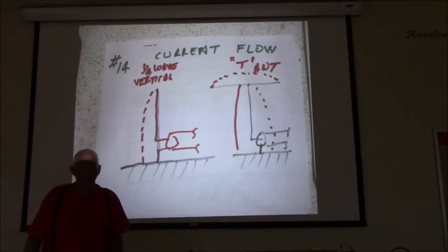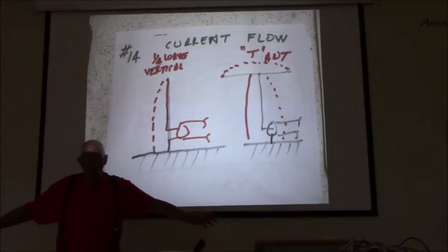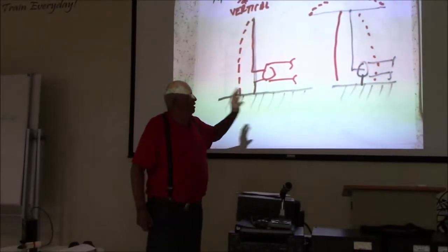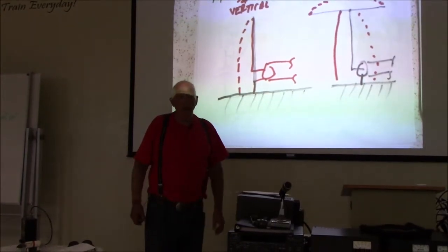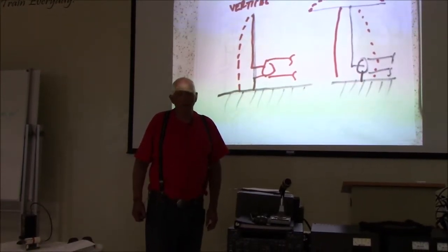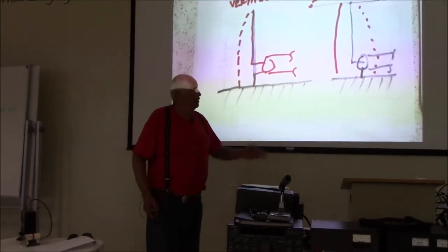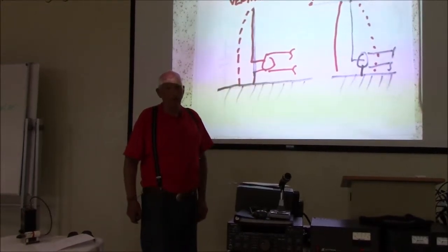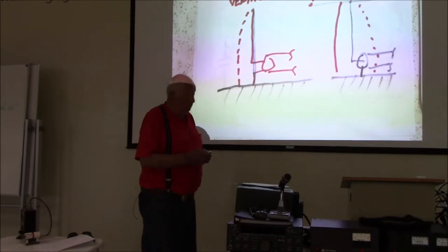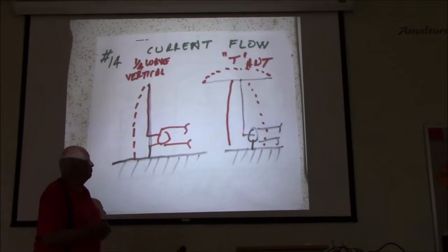So I built one, and I discovered that most of what was written in the literature was about using them on very, very low frequency. As a result, the use of these antennas on high frequencies had never really been developed. Nobody had ever played with them much up there. So there weren't any equations that enabled me to calculate the size of the antenna for a given resonant frequency. I just put up a wire between two insulators and hooked a wire to it and put it down to the ground.